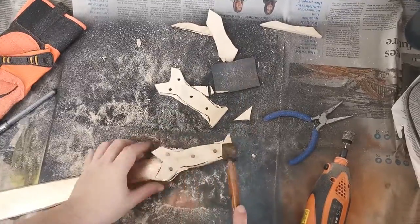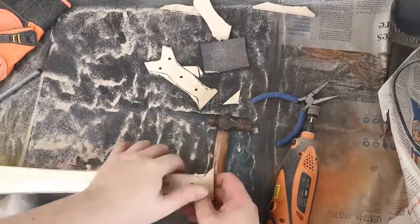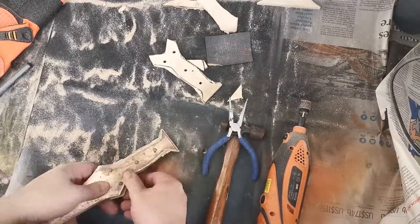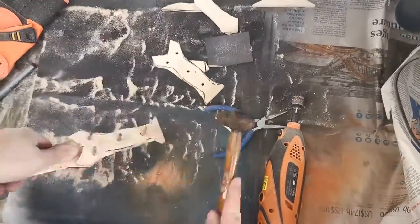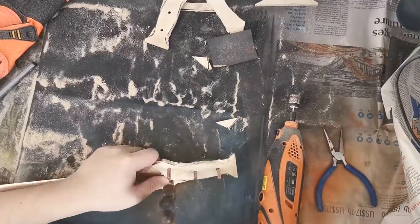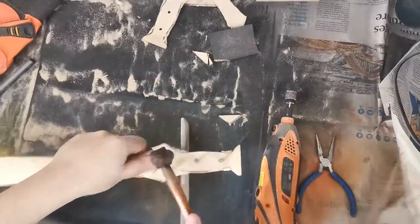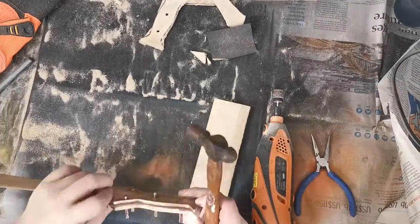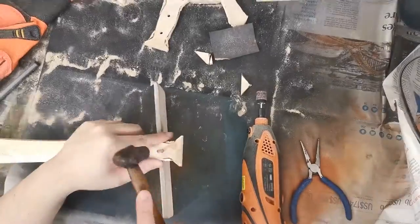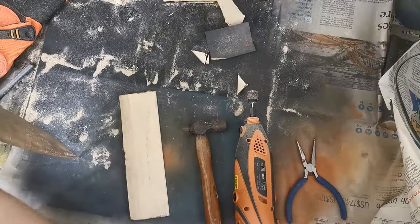Okay, so first of the mistakes here. What I think I should have done is get the pins all the way through the blade — don't have them too flat. I definitely made a mistake here. These are copper pins, they're a little bit softer and if you hammer them they'll bend. So there was some trial and error. If I would redo this again I would not have done what I did. The better way is to get your pins through the blade and then fit both sides of the wood on as best you can.